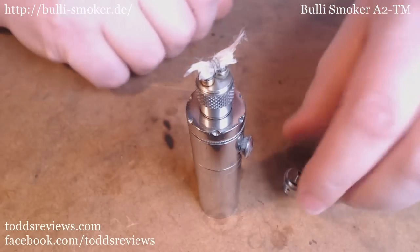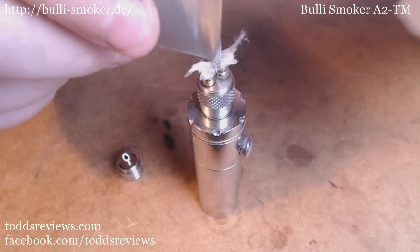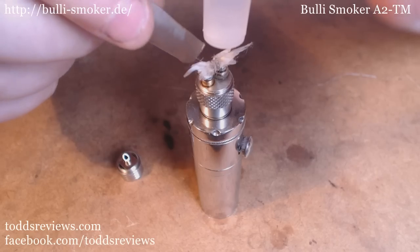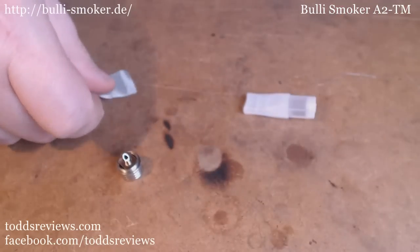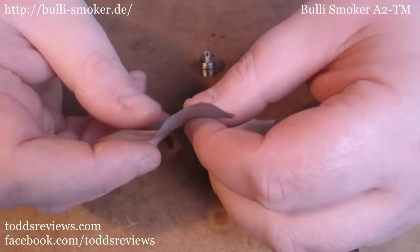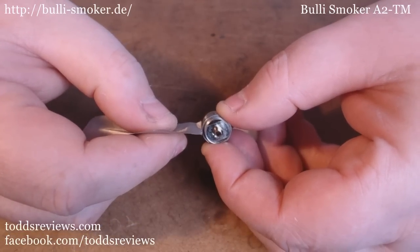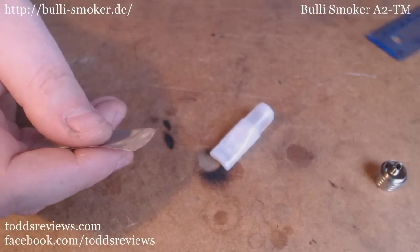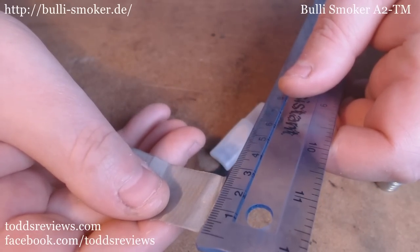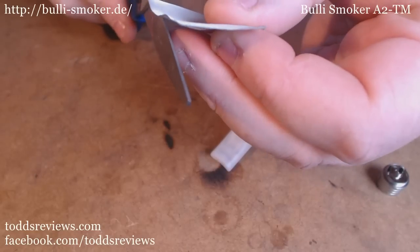There we go, she's heating up. Let's pop a little bit of juice on here. Excellent. Right, let's get this idea. Clear the deck of tools. Now, what we have to do is get something that's going to sit right above this and then into the tank, and carry the juice down for us onto this wick — that's the next step. I've not even measured this or anything, I'm absolutely winging it. That's 24mm in size in height, and that's what I'm going to use — 24mm in height. So I'll just square this off. Width-wise, I'm guesstimating — I'll go for about 20mm in width.